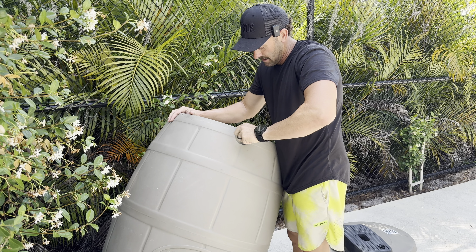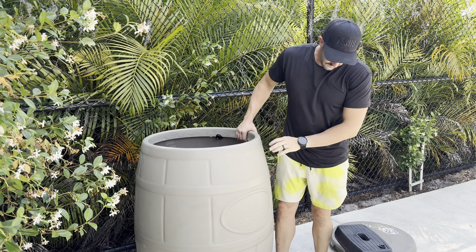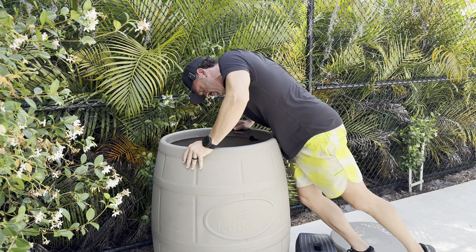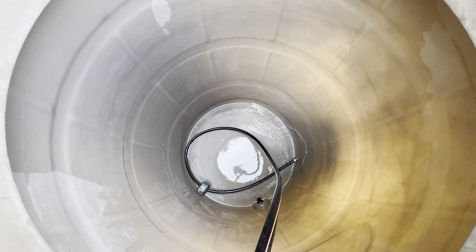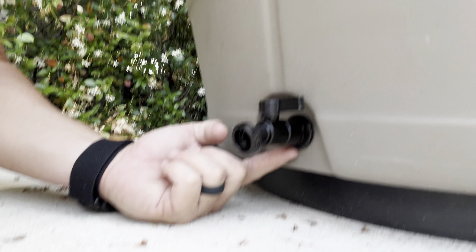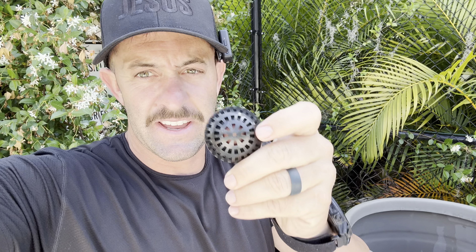Sliding the spigot in — probably easier flipped upside down — and just twisting it in. Got it on there pretty good. Then hand-tighten the pre-filter on the inside; no wrench needed for that part. At this point you should test it: put about a foot of water in and make sure it's not leaking before moving on. I checked inside and the water is over the spigot level — no water underneath, and water comes out when opened. We're good to go, no leaking.